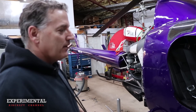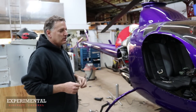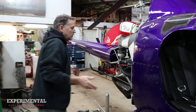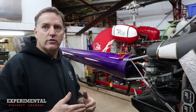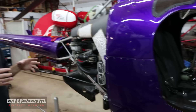Tell me what you did to restore or rebuild it. With anything, I believe if you're going to fly it — especially experimental — you should know every nut and bolt. So this was a ground-up restoration. I took it down to nothing, powder coated the frame, and did every reassembly procedure myself, making sure that all the angles and distances were exactly where they were supposed to be.